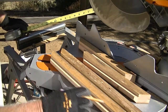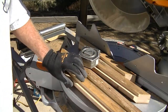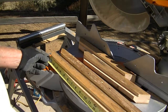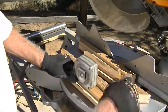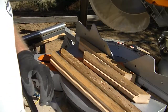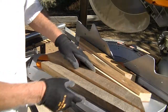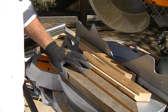So I just want to clarify that — even though I don't have to worry about that — if you did have one that you had to make exact size, what you'd have to do is measure it. Say for instance if you wanted it 14 inches, you had an 11 by 14 picture — you'd measure from 14 over here and you'd end up cutting it way back over in here. You have to kind of mark it and then slowly cut it back to get it exact on your frame. That's a little harder — making the frame to fit the picture versus the picture to fit the frame, which I do in my metal pictures. Hopefully that clarifies it so you won't cut your nice wood too short or too long.